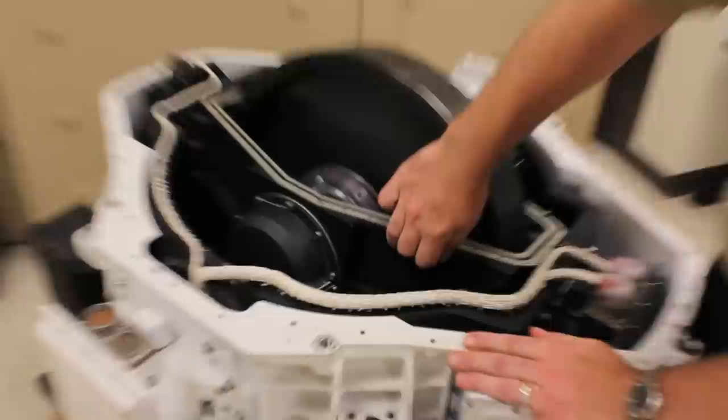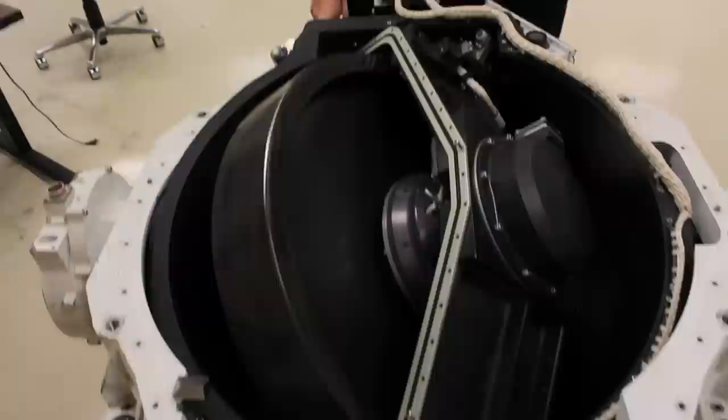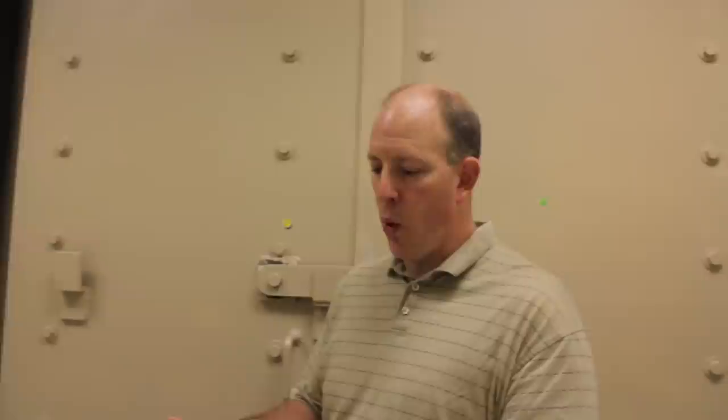And so what is this device that you have next to you? This device is a control moment gyro, or CMG. The difference between a reaction wheel and a CMG is that in the CMG, you can actually rotate its axis. This one has two axes of rotation. By doing that — yes, you've made a lot harder math for yourself. But there are a lot smarter people who make sure they know how to point the satellite or telescope and go from one point to another point along a specific trajectory. But if you keep rotating this, there's a point where it will stop — a locked position — and you can't go any farther, so you need some other system to get out of that locked position.